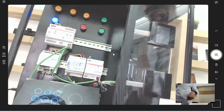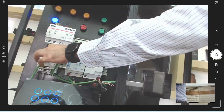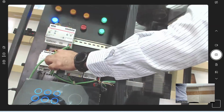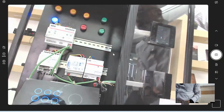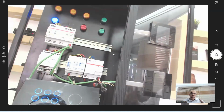What I need to do is configure A1 and A2 as relays. So when I click on and off, I can close them. They're not connected. And I want to make B1 and B2 not normal relays, but combine them together, interlock them together to simulate a shutter, a motor. In a motor, you cannot have both directions going together. So if you are going clockwise or up, it will be one direction. But if you choose the other direction, then the power will be cut off from the first one automatically.